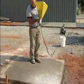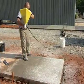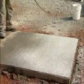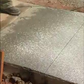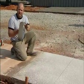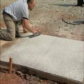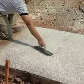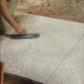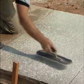Let's show you how it works with an actual cement-based topping. This is what we call a splatter-down finish. A lot of times applicators will create what we call a knock-down finish. It's great to use a pool trowel — if you use a square edge, it could drag the material. You're just kind of flattening it down. This is a nice finish around a pool deck, for example, where you flatten off the tip, so it's much nicer for clients to walk across something smooth as opposed to something coarse. And this is the knock-down finish.